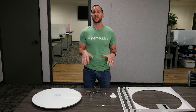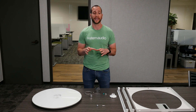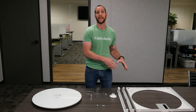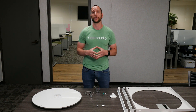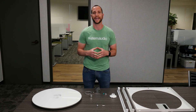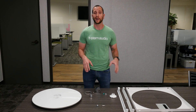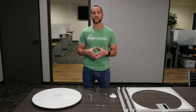Up in the front we have some nuts and bolts — those are going to be used in conjunction with the actual metal tile and the crossbars, and that is a separate installation for the dropped acoustic ceilings. So you're not going to need all of this hardware for the installation. The only thing that's missing and it's important to mention is the grapple kit. The grapple kit is intended only for the ceiling tile mode and it helps you secure the ceiling tile to the actual structure per regulation in certain states and also for general security and safety.